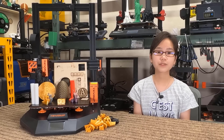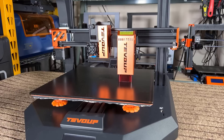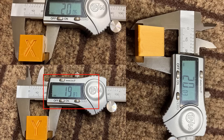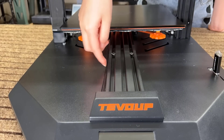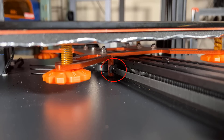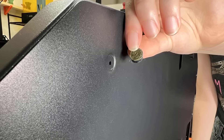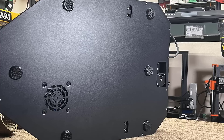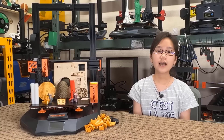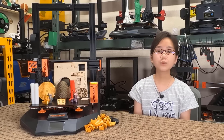Five, this printer comes with almost all the latest features you can expect from a new generation 3D printer. Surprisingly, it does not come with belt tensioners, and when I printed the calibration cube, I could see that the Y axis is a bit off as the Y belt tension is looser than the X belt. But since the difference wasn't that bad, I will keep using it for a while. When you need to adjust it in the future, I will cut the belt and re-tighten it with zip ties. Six, the small rubber feet under the machine are just secured by double-sided tape — the adhesion is not strong enough and it comes off too easily. I printed some TPU feet and secured them again with better quality double-sided tape, although glue would be better too. I think these feet are very important, as the stepper driver cooling fan is at the bottom of the base, so we need the base to be raised above the table to make sure the fan can draw cool air from outside to cool down the stepper drivers.